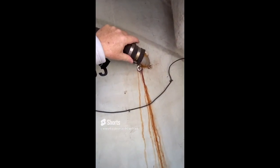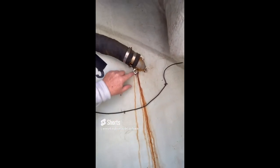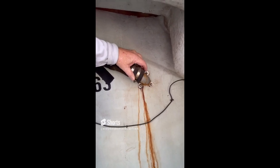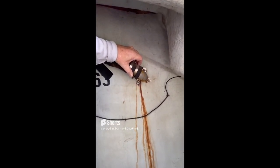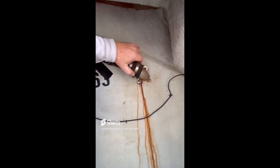For today's find, we're looking at a mid-sized catamaran, and you can see this running rust due to corrosion at the mounting hardware for this stainless steel exhaust outlet. As we've discussed in previous videos, running rust, leaks, and stains are your boat's way of telling you something's going on — and typically that something's not going to be good. The recommendation here would be to pull this and inspect it to see what's going on.